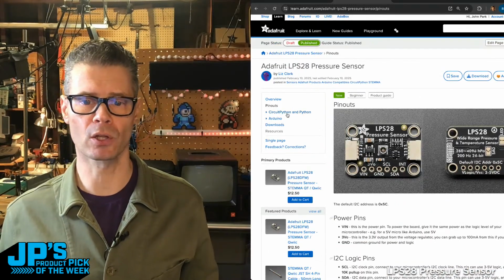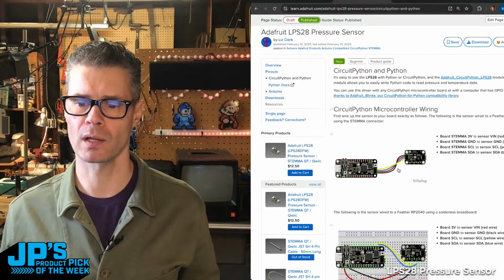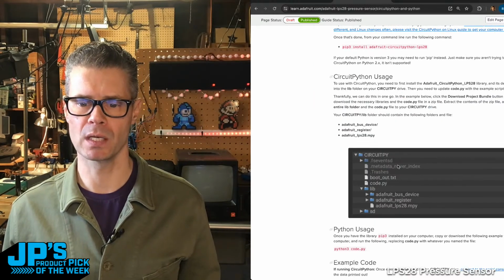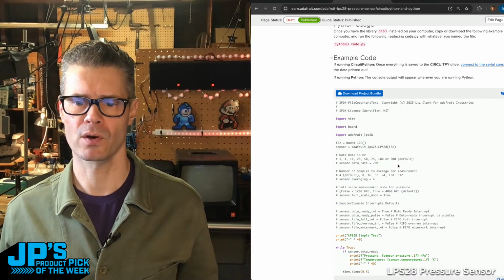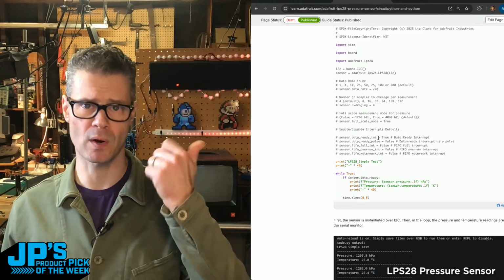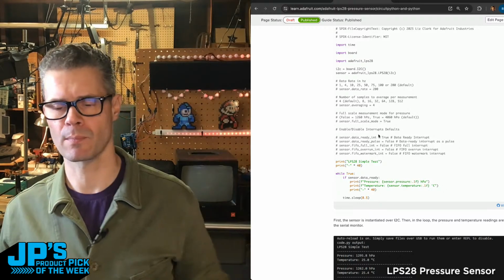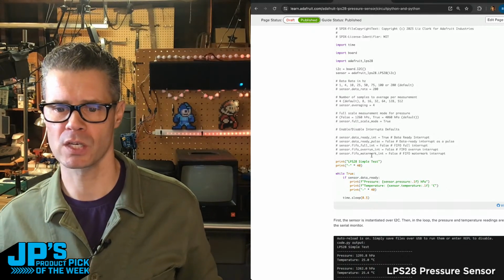If you take a look at this CircuitPython and Python link, this will show you a little wiring diagram for both the microcontroller and for using on a Raspberry Pi, and then the setup that you need to use it in either of those, CircuitPython or Python. There's a nice little demo code here that will show you the temperature and the pressure. As you put your hand in front of it, you might see the temperature go up. If you try to blow on it or suck on the port, you might see a change there.